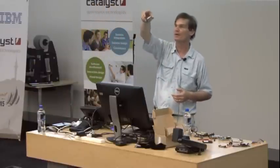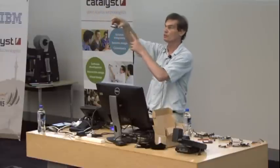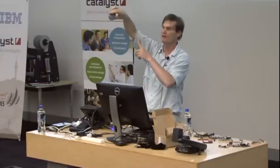So it's flying along. The only difference is that, with a wobbly hand, it moves around like this, so it's got a gyroscope as well, so it can compensate for the rotations. And what that gives you is basically the ratio of your height above the ground to your speed. So if you've got your speed from GPS, you can get your terrain height. You can actually automatically track what the terrain height is, great for landings. If you lose GPS, you can do great position hold, great for indoor flying, all sorts of things.